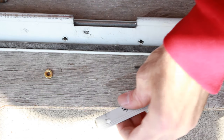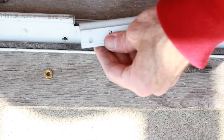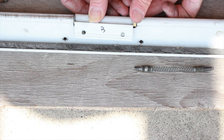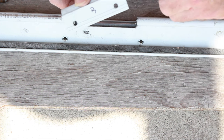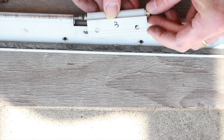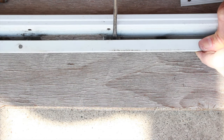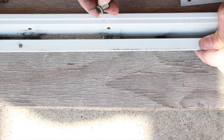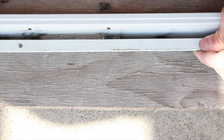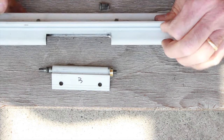So let's do a little mock-up to test it. The washer insert that's still in good shape will go in, the hinge goes back on, and then that spacer that we made out of brass is going to go there. The spring-loaded pins will be in there too, so that will all go in like that. Before I try to put this hinge back in, I want to take that broken insert — the one where the washer wore off and slipped down inside. That's the one that we backed off in order to pop the hinge out, so I want to move it back up in place.